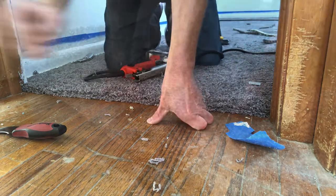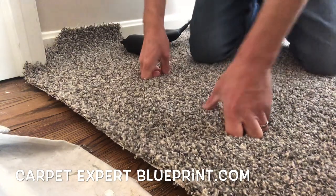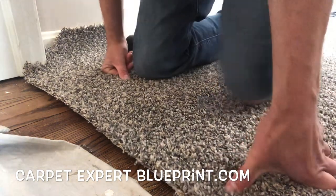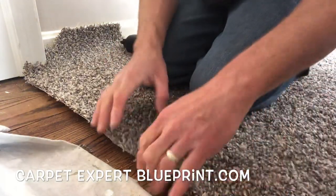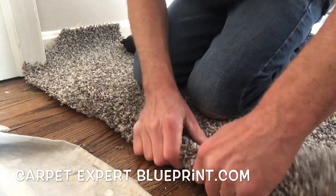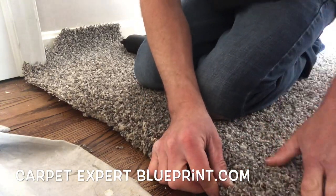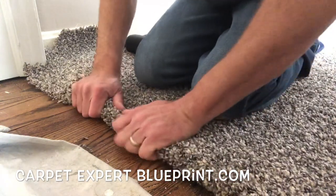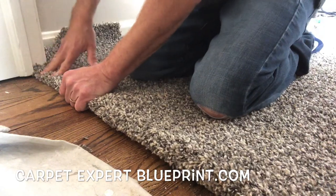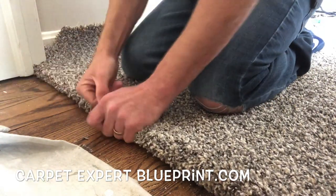Let's go ahead now that we're done here and do another doorway — similar scenario. That hardwood floor looks way nicer in this one, but the carpet we have in the doorway is way cheaper. So let's go ahead and do the same exact thing. We're going to fold that under, get it lined up where we need to be, roll it under, and get it lined up from door jamb to door jamb so when the door shuts, the carpet's under it and not hanging out in the hallway.